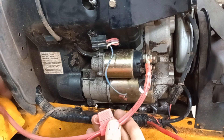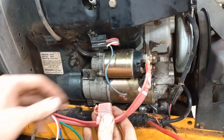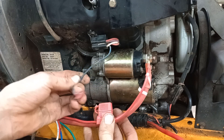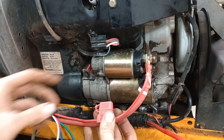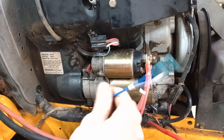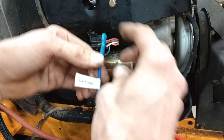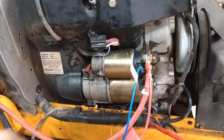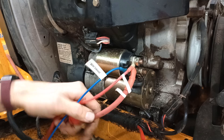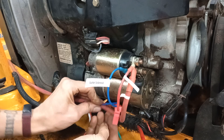There's your main power feed coming in. We're showing this on a 2000 series tractor because the engine is still in the frame, but it looks basically the same. Depending on your engine — this engine here has a five pin connector which integrates the starter solenoid wire — but the harness we're showing today is for a four pin, which has a separate starter solenoid wire. So we've got to hook that up. That's labeled starter solenoid, spade terminal, hooks up right there. Now you have those three circuits in there and you can route this however you want — running it in a loop and down along the frame would be clean.